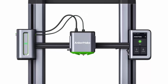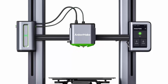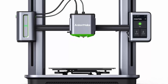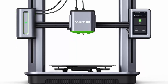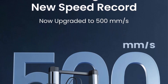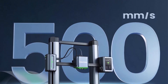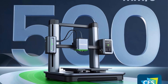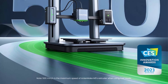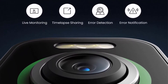Upgraded 500 mm per second speed: Power Boost 2.0 achieves smooth power output and increases power release by 30% compared to Power Boost 1.0, doubling the printing speed and acceleration of the M5 without sacrificing print quality. Simply upgrade the Anker Make Slicer, Firmware, and Anker Make app to the latest version to experience the new speed. Precise 0.1 mm detail is achieved thanks to a new ultra-direct extruder and integrated die-cast aluminum alloy structure, never compromising on stability or quality even at high speed.